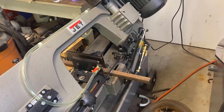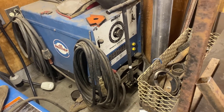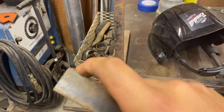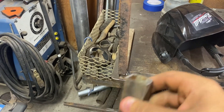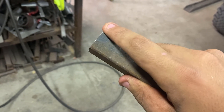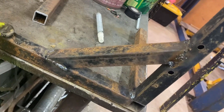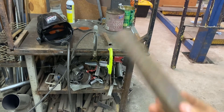Start doing the 45s — I'll show you how to do that. We've got our metal. This is about what it looked like before I cut the 45s last time. This is about where it wants to be. All you've got to do is cut the 45 from here. You don't have to do any special measurements — I just set the bandsaw to 45, cut along that corner for both sides, and do this shape right here. You pretty much get the result that you're after.